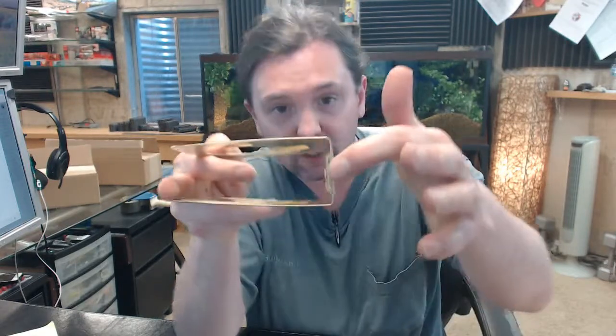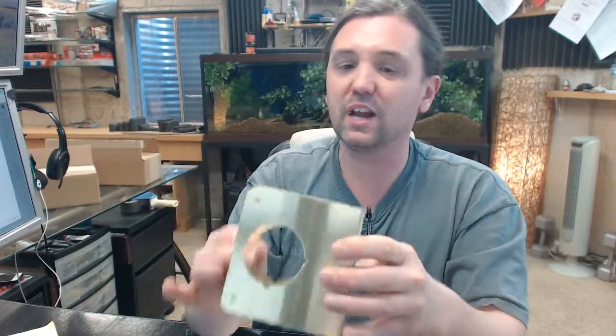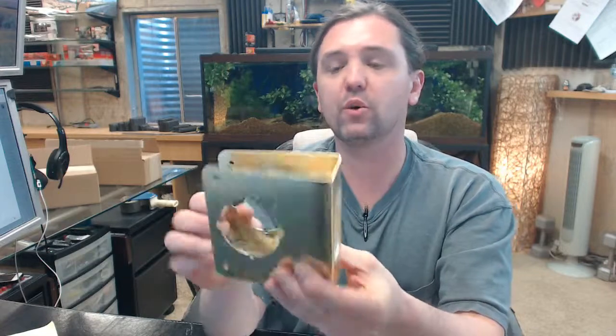If your margin is incredibly tight, keep in mind you're going to be adding this material thickness. Hopefully you've got at least 1/8 of an inch gap between the door and the frame. Otherwise this will increase the amount of force required to push and pull the door open. But in residential wood doors, there's generally an adequate gap there.